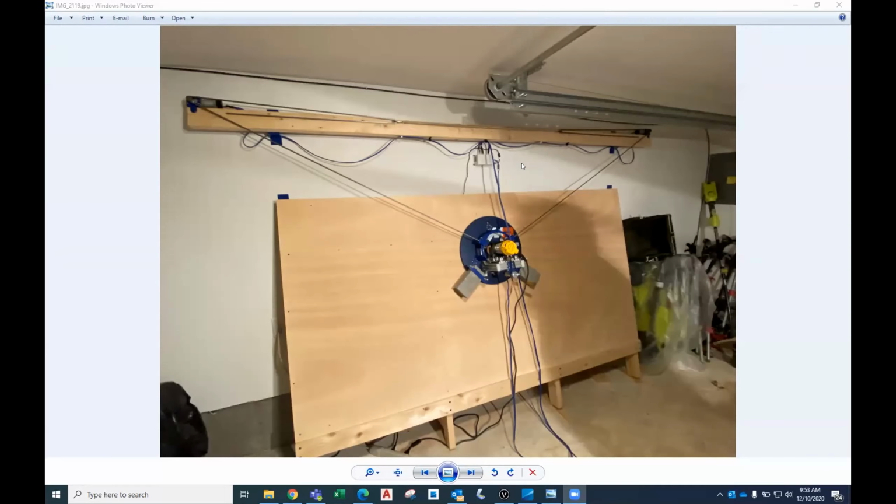And then the nail placement, the way that you can test that nail placement is if you just slowly jog your machine to the upper right hand corner. And then just make sure that your drive chain doesn't come in contact with that nail. Perfect. No, that's excellent. Cool. All right, that's great.